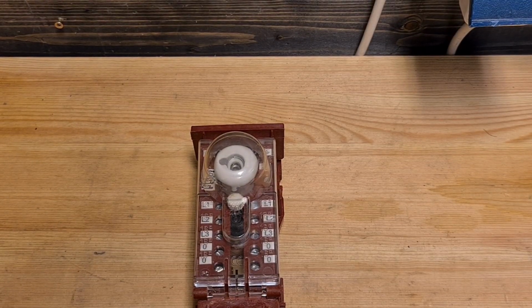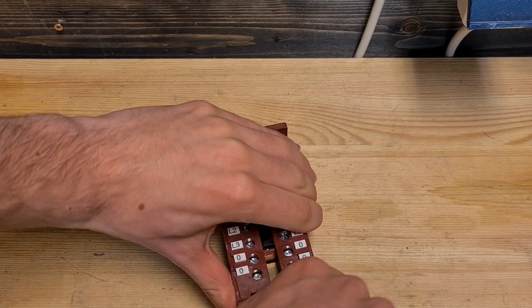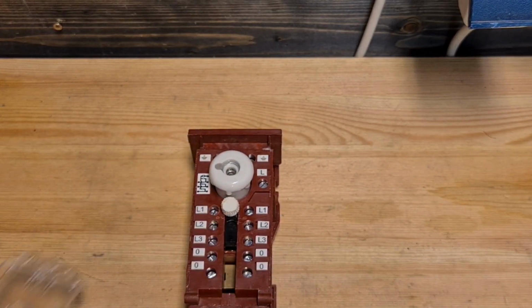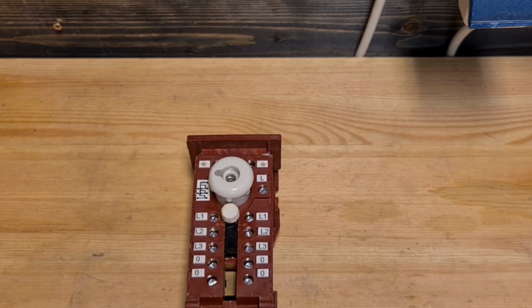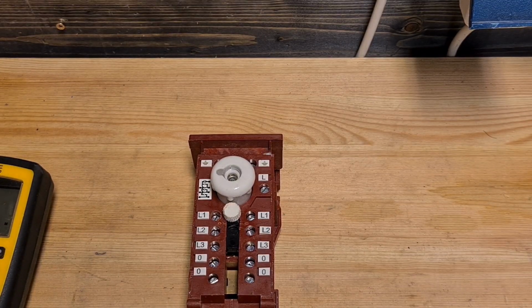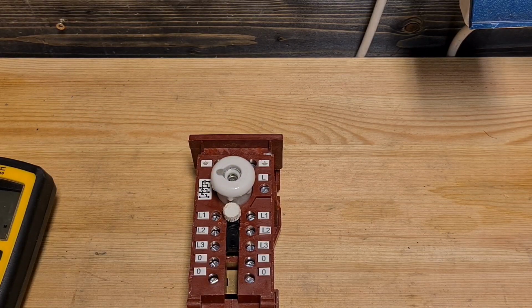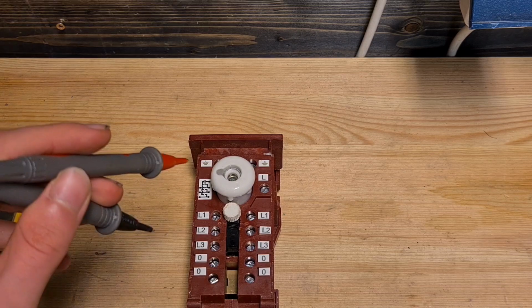So here we have one of those fuse boxes that isn't connected, the red ones. This is just one for only one fixture, but I can show how it all works. We in the Netherlands normally connect the ground and the neutral. I don't know why, honestly. I'm not an expert in how it's supposed to be outside, but in some installations we use these, and as you can see, the ground and the neutral are separated here, so I can just use these in the garden. And these also get used outside too.